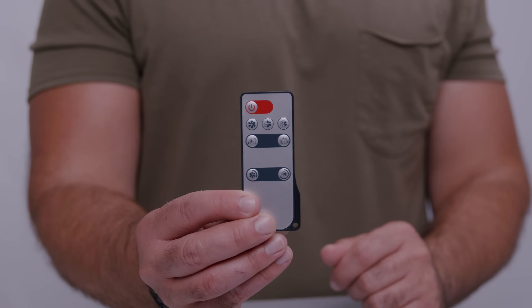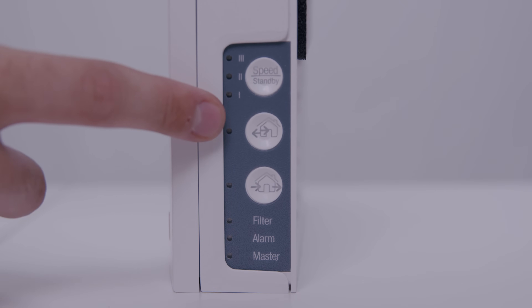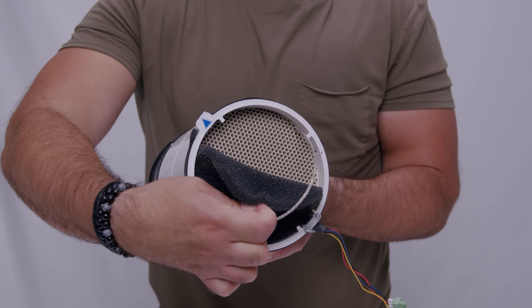So what's in the box? Well, not a lot actually, and that simplicity is part of this unit's charm. The Vents US TwinFresh Expert ductless ERV comes with the remote control, the outer ventilation hood, the inner control panel with air shutters, an air duct, and the ceramic core heat exchanger with MERV filters. The unit can be plugged into an outlet or hardwired by an electrician.